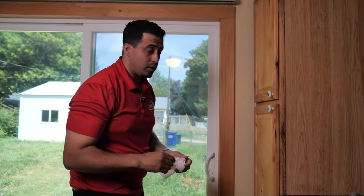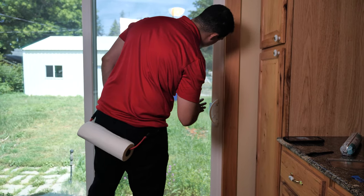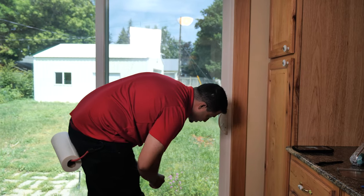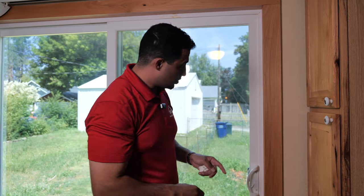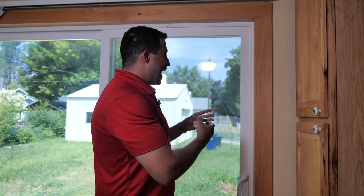All right, we're going to double check now — look through and make sure we've got full adhesion, a full quarter inch bead all the way around. Looks great, it's got full contact. Everything looks solid. Now right here, if you notice, there's a little bit of excess. I'd advise you not to try to clean it now — allow it to cure, then take a paper towel or your hard card and take that piece off once it cures a little bit. If you try messing with it now, the silicone is still wet and it's just going to be messy and very difficult. So let it cure and then take off those small imperfections later.